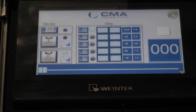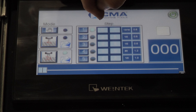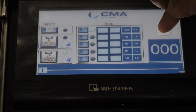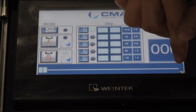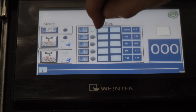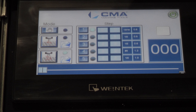To load up your first step, make sure number one is selected and your green light is on. Hit the green check mark and it will turn off. Now the most important step is to make sure that the slider bar down here is all the way at zero. If it's anywhere else, it will not load your pre-programmed RPM — it will kick you out of this mode and back to standard mode.